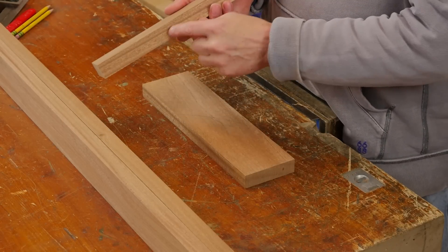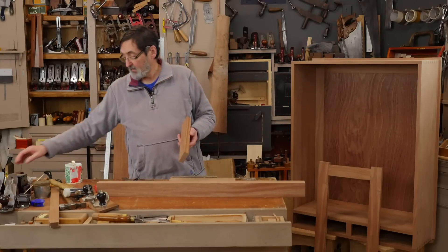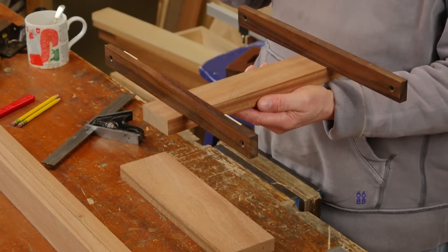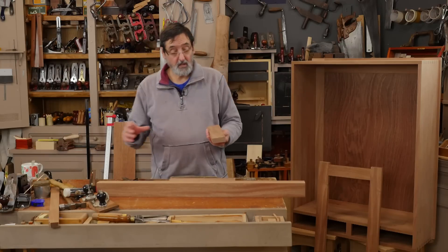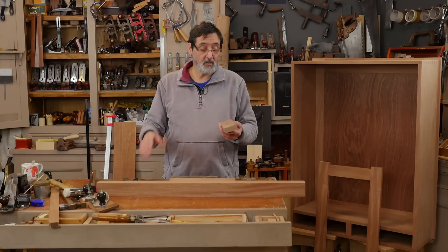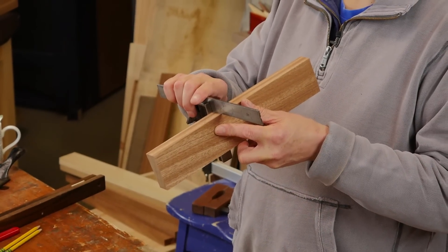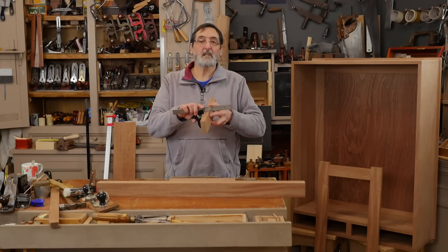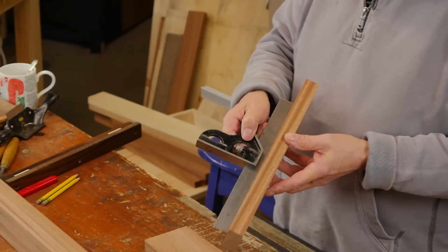I've got my face mark on here and face edge on here, which means I have straightened the wood and taken out any twist. I've checked it for twist by using winding sticks like this to make sure the piece of wood is completely twist-free. I milled and hand-planed this yesterday and left it overnight, then checked it again this morning to make sure no twist occurred because of atmospheric changes. I've also checked the edges for square - these have to be dead square. If when you make a mortise hole and you put shoulders on your tenons the mortise edge is not dead square, you can actually clamp twist into the door.